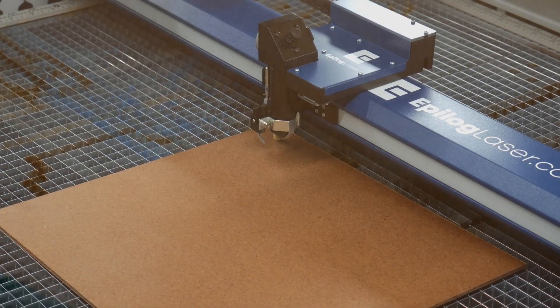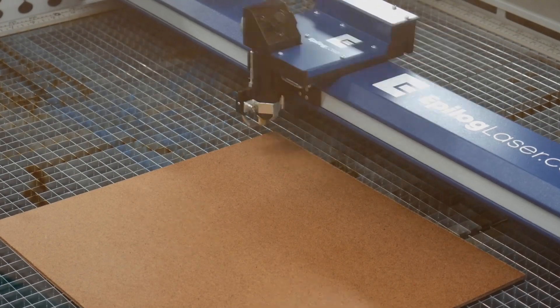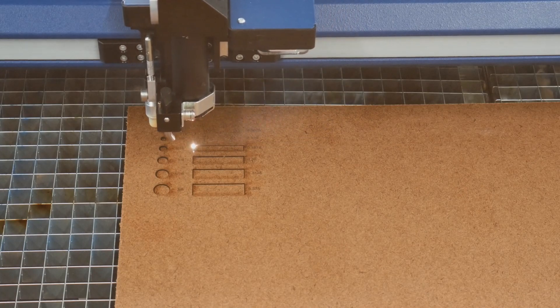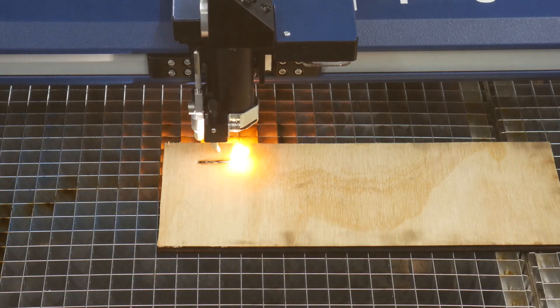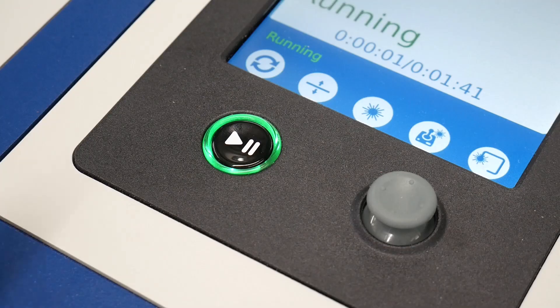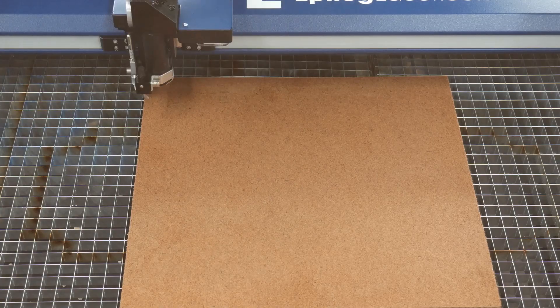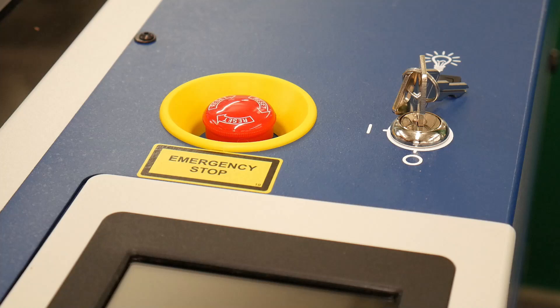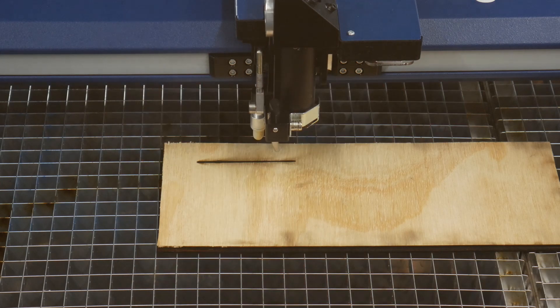Exhaust and Air Assist is automatic. Please watch the laser attentively and stay at the laser cutter until your job is finished. If you see an open flame, you need to adjust settings, such as moving faster and/or delivering less power into the cut. While the laser is running, you can pause the job by pressing the Pause button. Resume the job by pressing again. If you need to abort the job, you can pause it, then press the Reset button on the touch screen. In case of emergency, hit the red Emergency Stop button. This will automatically stop the laser from firing, as well as cease movement of the gantry head.